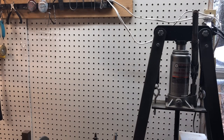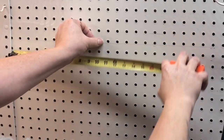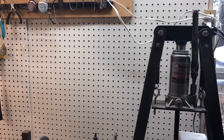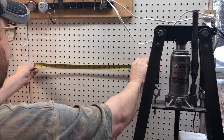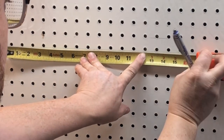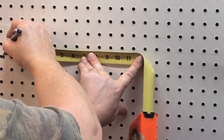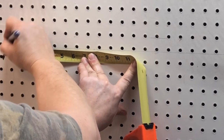So that's going to be level. The center of this shelf is 21 inches, so that is 10 and a half inches from either side. We've got 16 inches between the D-rings, so half of 16 is 8. One screw is going right here, one screw is going right here, and a clip right here.